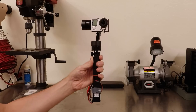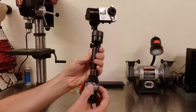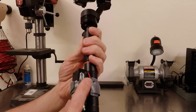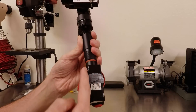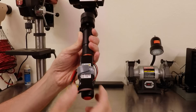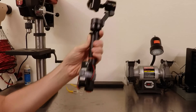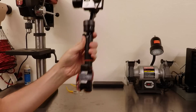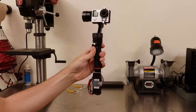Here's the finished product. I don't use anything fancy to hold the batteries to the gimbal — just an RC Velcro battery strap. The particular strap I'm using happens to fit perfectly in the smooth spacer portion of the battery compartment. I generally wrap the battery wires around as well to help hold everything in place. Once that's done, the battery really doesn't want to go anywhere. Hopefully this will help put an end to any gimbal battery woes you've been experiencing. As always, make sure to like, comment, and subscribe.